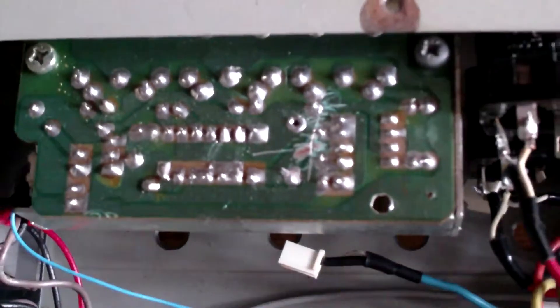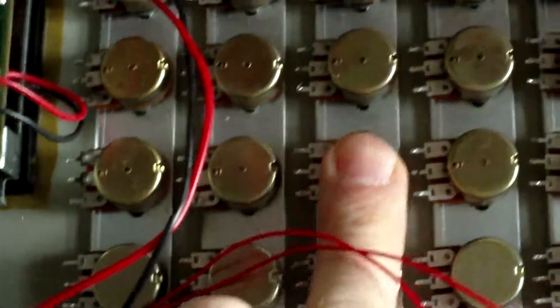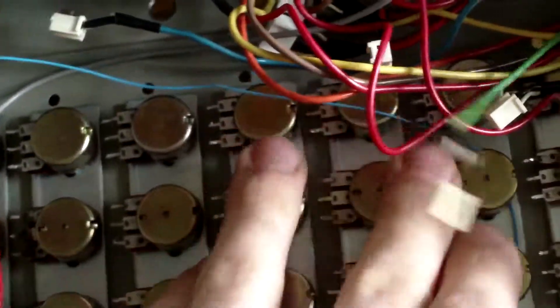Since I'm not using it as a MIDI through, I just made it into a MIDI out, and I'm just cutting a few wires there. It seems to be working fine. The only problem now is I don't have enough multiplexers to connect the rest of the box — I'm just hoping to do that in the future.